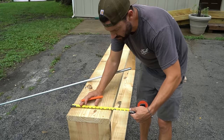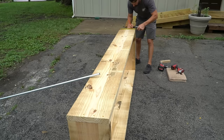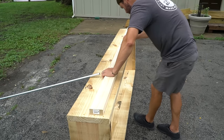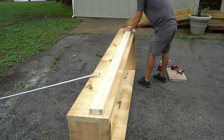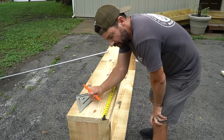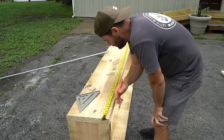To do that we're going to measure down on one side — right at about nine and a half inches from the top. We'll strike a line right at that nine and a half inch mark, then make our marks for the conduit. We'll come three and a half inches over for the first hole, and then go two inches every single time after that.